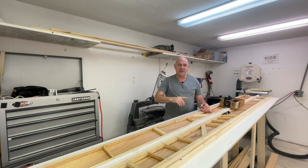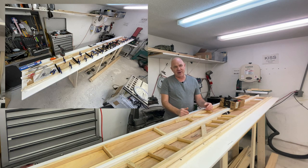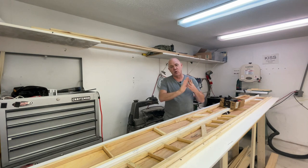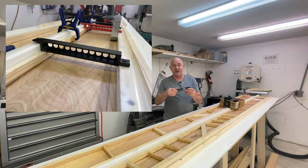Hopefully you're seeing some pictures of the spar work. On clamping pressures — I know I've gotten into big heated debates about that. With aluminum, yes, you can starve the joint by creating too much pressure and squirt out all the epoxy. But with most woods I've tested, unless you get ridiculously stupid and start crushing the wood, it's hard to get the pressure too high. I did 3D print some neat little clamps that help hold things down to the table I built.